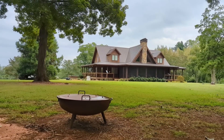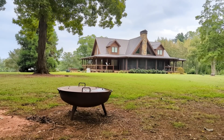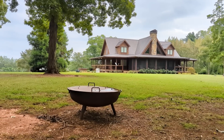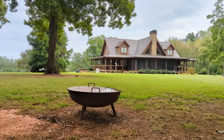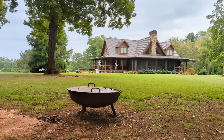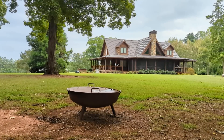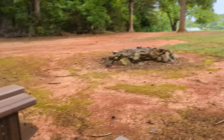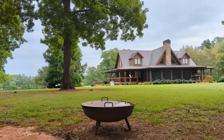We're always making solar priority, and then we can run in any combination: grid and solar, grid or solar and generator, or just generator. That takes a few transfer switches and some explaining. It usually takes a few grid-down situations for it to sink in with the customer, no matter how well-labeled your equipment is. So today we're getting the transfer switches run out, all our disconnects in place, and pulling wire. Plenty to do.